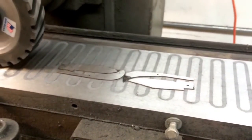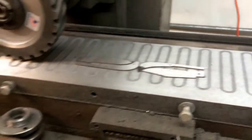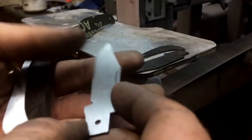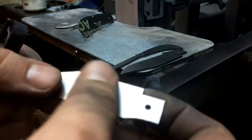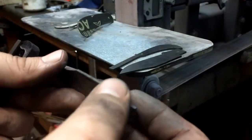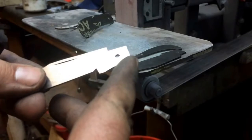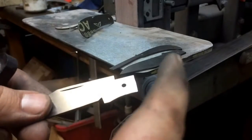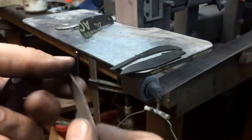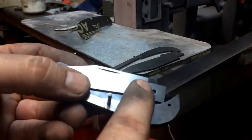Let me go ahead and set up for that. I'm going to finish surfacing these to a pretty decent polish and then we'll resume filming. We're pretty much done with our surface grinding so that everything's nice and flat and parallel and has a relatively decent polish on it. Right now our tangs are pretty much what they're going to be for the assembled and finished knife as far as polish and flatness. I do still need to take a little bit of material away from the cheek when I start assembly as well as the bottom of the tang, and we'll dial that in after a while.